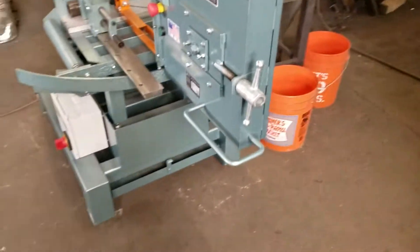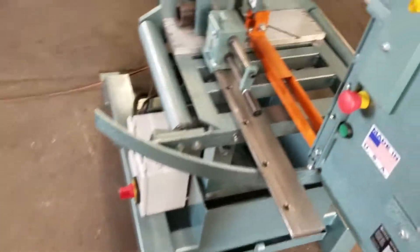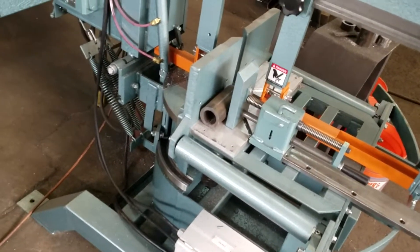A little reminder: if you want about 8 to 10 lbs of pressure in the first inch of travel, that will save you on blades. Because no matter how hard you try to adjust this, if you have 20 lbs of down pressure it's going to eat your blades right up.